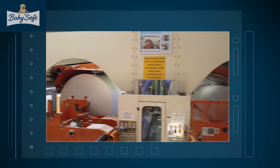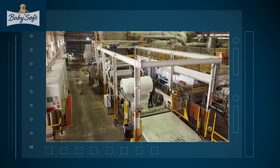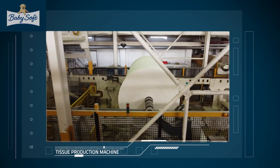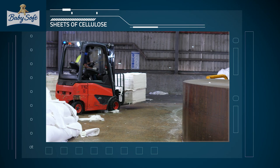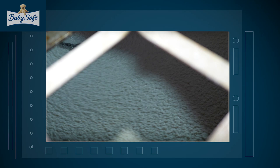Not only do they make the toilet rolls in this factory, they also make the toilet tissue here. So let's jump back to the beginning in a different section of the factory and see how the actual toilet tissue paper is made. Toilet tissue is made mostly of cellulose. The cellulose comes into the factory in sheets and is tipped into a pulper by a forklift. Inside the pulper, the cellulose is mixed with water and refined to release the fibers into the slurry.